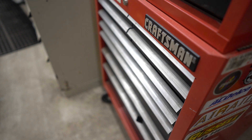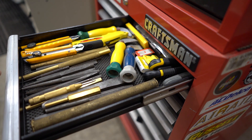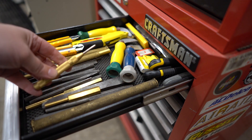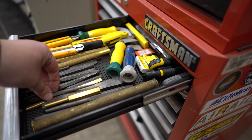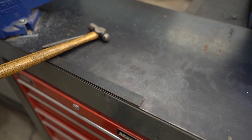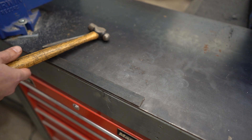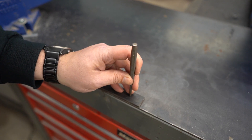I'm sure everyone has tried drilling a hole in metal, only to have their drill bit walk all over the place and leave a big squiggly line instead of a hole. In order to get a hole where you want it in metal, there are some steps you have to take first. To start, you need to measure where you want it — we covered that earlier. And once you have it marked, if you center punch it, you'll give the drill a place to rest so it won't walk all over and ruin your piece.